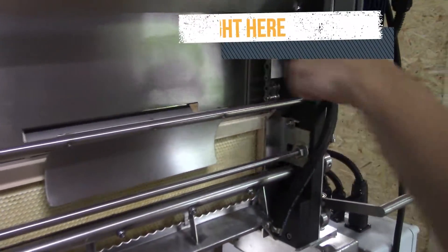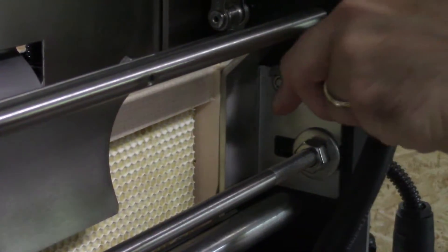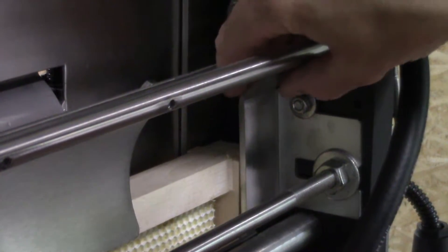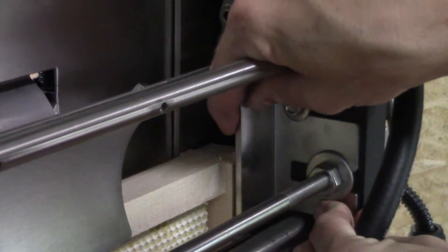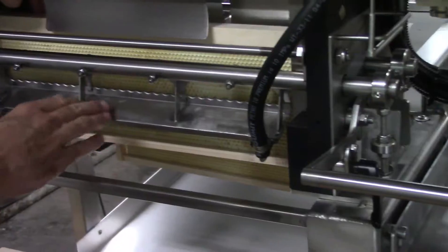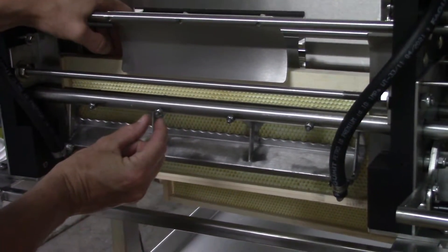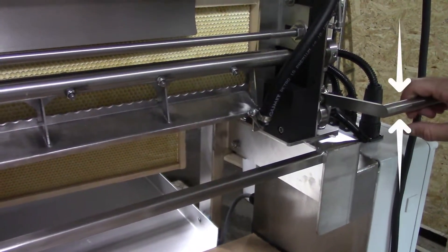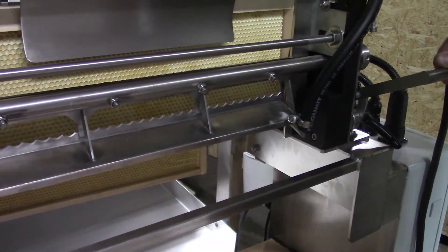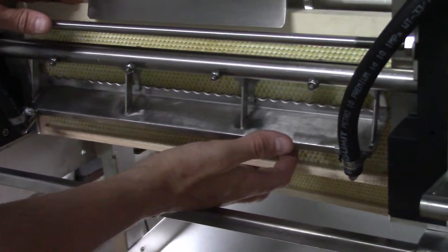So here's where it's too tight. To create a gap here, we'll loosen these two nuts and then slide this outward — this is a carriage bolt on the back side. So now we're just going to move this parallelly out. This is adjusted to the minimum setting right now, so that's as low as I would ever want to uncap. Moving this handle up and down moves both blades in and out, so you can uncap shallow or pretty deep. See the space under this knife gets bigger or smaller. There is some play in the frame, and the play depends on how much propolis there is. We'll start with this as our initial adjustment.